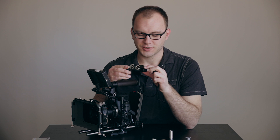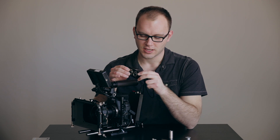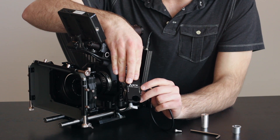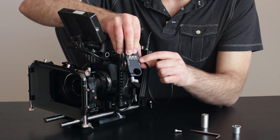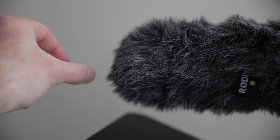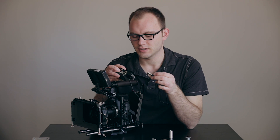It's just a breakout box. It has two XLR ports, labeled 1 and 2. Interestingly, they use the exact same box for all the different models — on the side there are outputs labeled 1 and 2, but on this particular unit it only has one. So what you're going to get is a left and right mono combined. I've done some testing where I had a lapel on one and a shotgun microphone on the other, and I was able to separate them in post and play with the levels, which is cool.